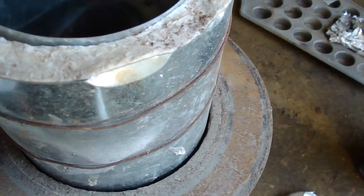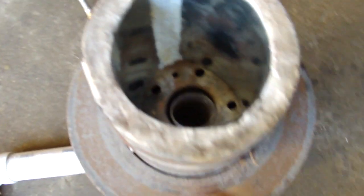Sometimes. Come on, honey bun. This little tab doesn't want to fit. There we go. So that goes all the way down like that. And then our crucible, which is made out of 1/4-inch steel, will set in there. Actually, I'll spin it like that. And then we just melt down random scraps of aluminum. Oh man, I'm itchy. That kaowool, I hardly did anything and I'm really itchy. It's bad stuff. But I'm gonna light this up and show you guys how it works.